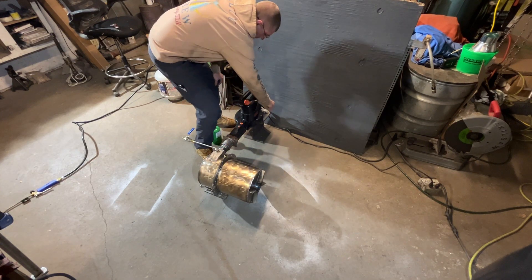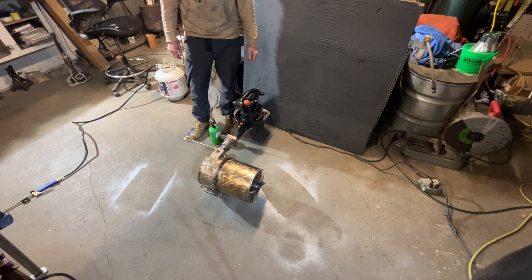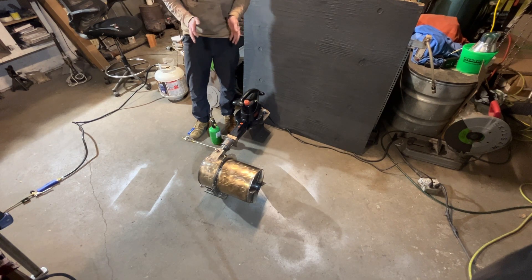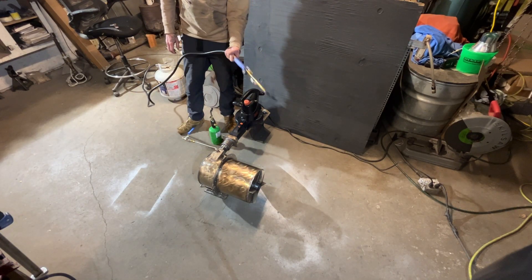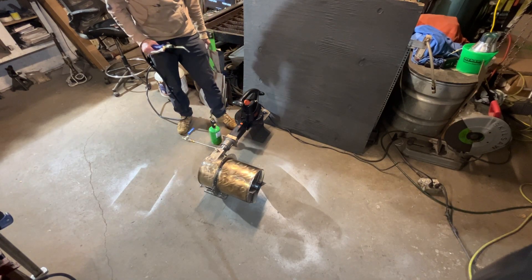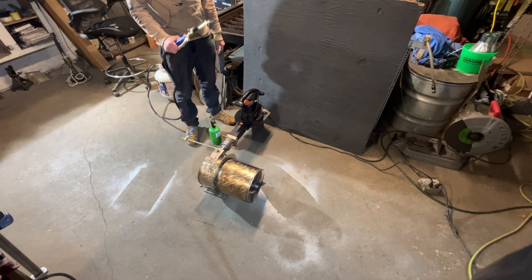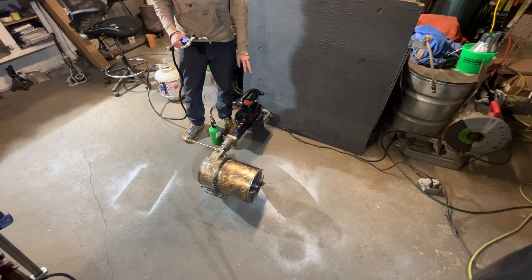What we're about to observe is the process of a propane assist ignition setup. Lighting jet fuel without some type of atomization is very difficult and dangerous. So we're going to first light the burner using a propane lance, which is basically just a repurposed rosebud burner. To do that, we're going to start off with very low air on the blower and a pretty large amount of fuel — we want a very rich mixture to avoid any explosion.